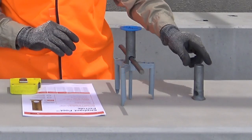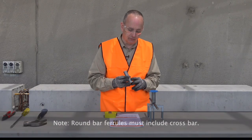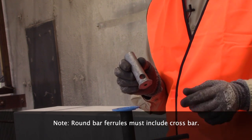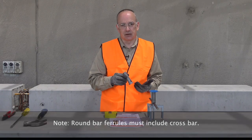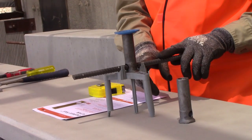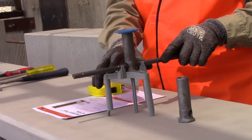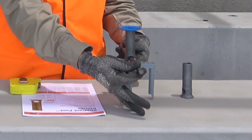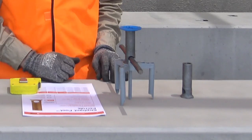For the elephant foot, we don't need a rebar through the ferrule hole to generate capacity — all of the capacity comes from the enlarged foot of the ferrule. We can use the crossbar through the ferrule to help tie it into the reinforcement. Especially in near face applications in a chair, it becomes very easy to place the ferrule and chair as an assembly in the formwork, then tie the bar off into the existing reinforcement to keep it safely in place.